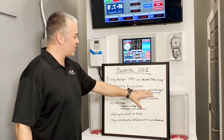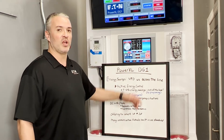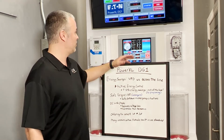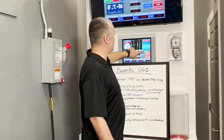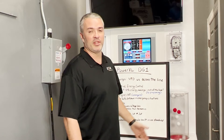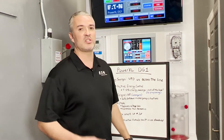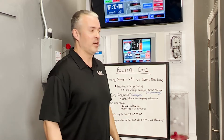With this demonstration, we have a couple of different tubes to show what it's like with the blower motor and how much airflow we'll be using between the two different applications. I'm going to go ahead and start the starter. If you listen, it's actually going to slam on because it's going to jump right to 60 Hertz as fast as it can. You're going to get that six times inrush current from that motor.